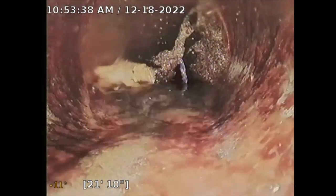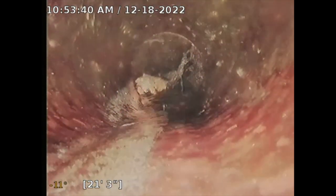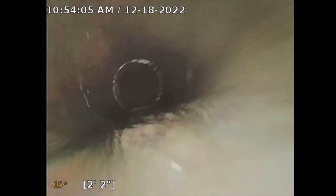At this point I recommend further review and repair by a licensed plumber. They'll probably have to hydrojet this line to assess the damage — right now I can't properly assess it. You have to hydrojet it and then they can give you a proper price quote. I'll note the tree roots in various areas and recommend further review and repair by a licensed plumber. A sewer liner would probably be the best option on this one. I'm exiting the property now — this concludes the inspection. Feel free to give me a call if you have any questions.